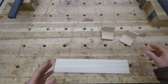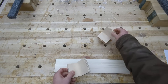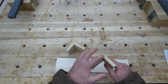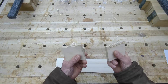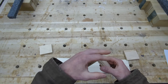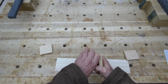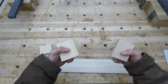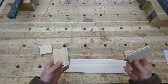Also consider how you're stressing your glued-up joints. If I have plywood in a form where it sees a lot of leverage — a big lever arm — it doesn't take too much strength to break those joints. But if I position it so I'd actually have to shear the joint off — try to slide it apart in any direction — this thing is incredibly strong. So let me show you how I use these principles in the cabinets installed in the van.